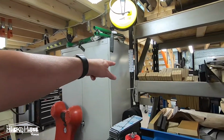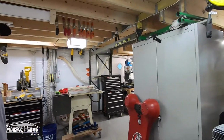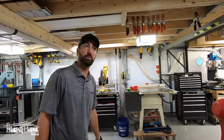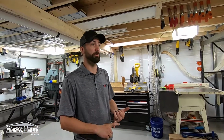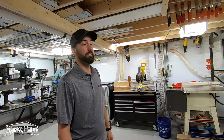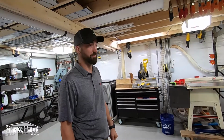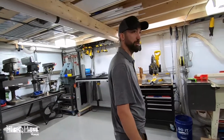What are your templates here for? Those are the bending jigs for putting the vertical trim pieces on our splitters. Basically all new edge and back front splitters have a vertical component to them. And that's how I figured out the best way to put them together. I used to use a Sharpie and draw on the parts where the piece was supposed to go, and I had to bend it by hand as I went. This makes it easier for installation. Way easier, yeah. So I cut assembly time in half.